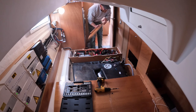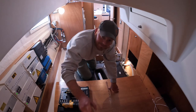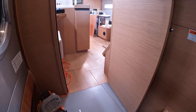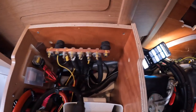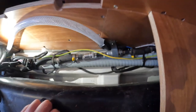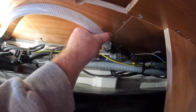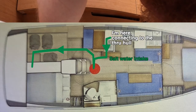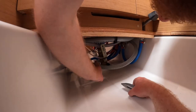I can see now exactly where that tube got stuck. I ran the fish tape from under the floor by the fresh water manifold that's by the stairs over there - under the floor you can see the clear tube in the bottom right of this corner. I tied a line to it and taped it up, and I was struggling because it was getting stuck - and you can see exactly now where it was getting stuck. We've got a through-hull here; this is going to be the salt water intake, and I'm going to connect to this guy.